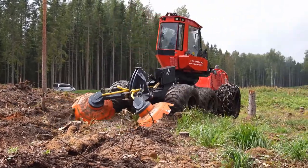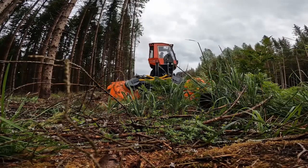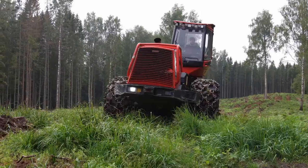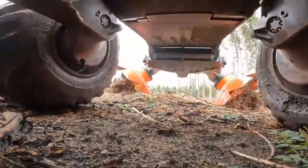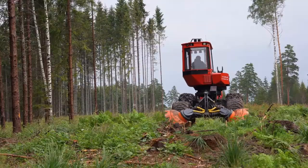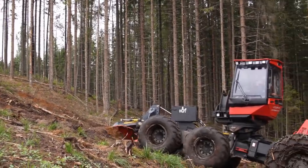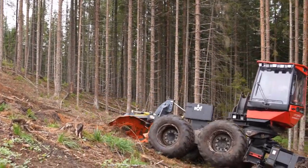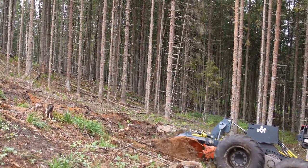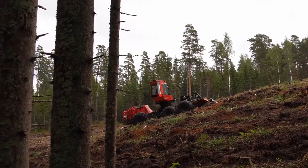Equipment specifications. A disc trencher has 2 rotating, spring-loaded discs, each with approximately 10 teeth on its perimeter. The discs are mounted on each side of a steel box frame. The discs face outward and forward on the frame. Models are available with freely rotating discs or power-driven discs. Disc trenchers weigh from 2 1/4 to 3 1/2 tons, are about 8 feet wide and 7 feet long. They require a prime mover, either a crawler or a skidder, of 120 horsepower or more.